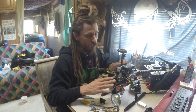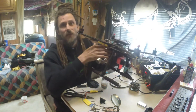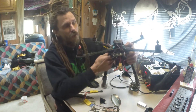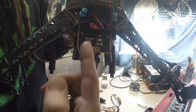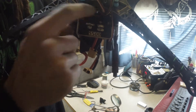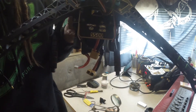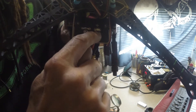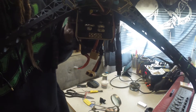First thing that's most important - if you don't watch any more of this video, watch this part. On the back here you'll see there are solder connections for your power input and your power supply module. See the plus here? See how this is shaped like a minus? You might think that's positive and that's negative - it is not. This is positive and this is negative.